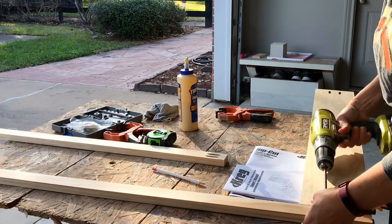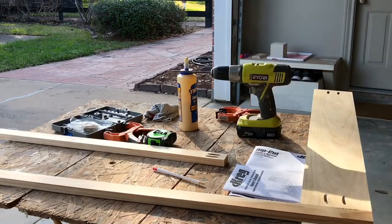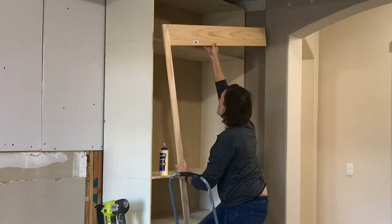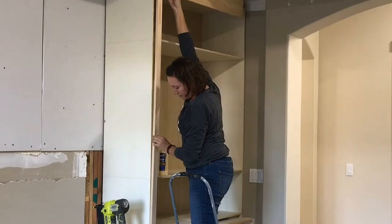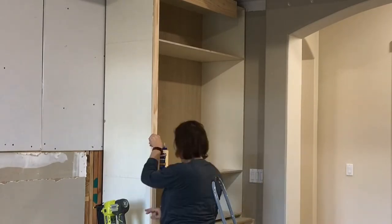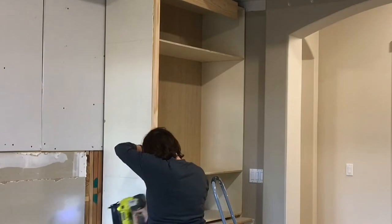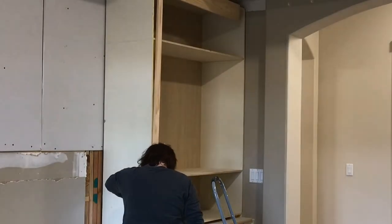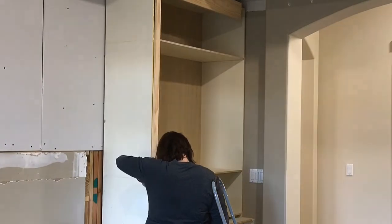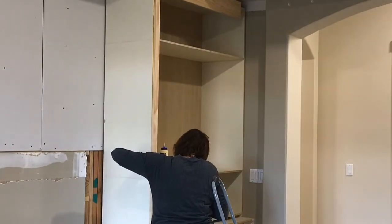So I decided to just use wood glue and my brad nailer to attach the face frame directly to the upper cabinet. I'm using three-quarter-inch select pine as the face frame — since I'm painting, not staining, that affects the material and joinery decisions. I started by attaching the piece I wanted perfectly flush with the side of the plywood, using wood glue and the brad nailer, making sure as I moved up the board I kept that select pine perfectly straight and flush with the plywood so you won't be able to see the seam once painted.